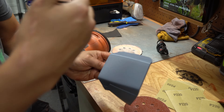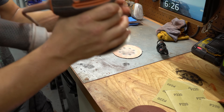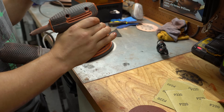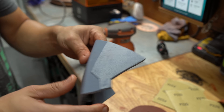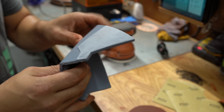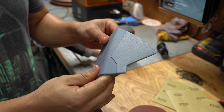I'm working on a new sanding tutorial for prepping 3D prints, but I want to show you on this raw knee print the difference the power sanding makes through the whole sequence. Starting with 60 grit at medium pressure — a little more than the weight of the sander. Already it's pretty smooth, but you can see there are two pretty big layer lines left. With the power sander I can hover over those spots carefully back and forth and pretty much make them disappear, though the whole thing is still pretty rough.